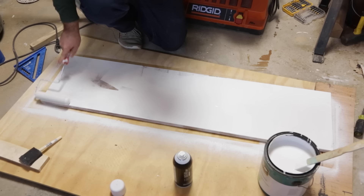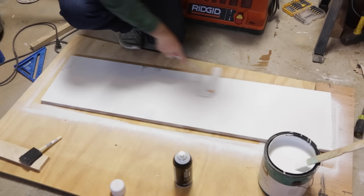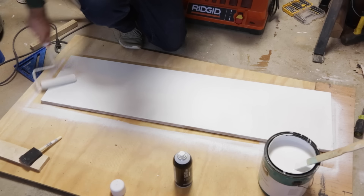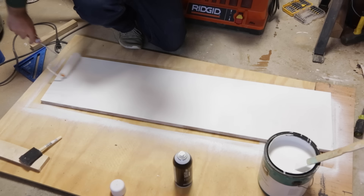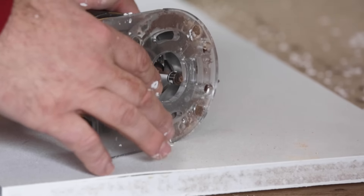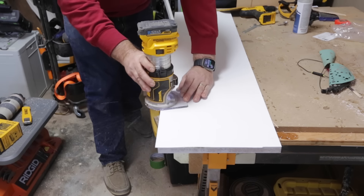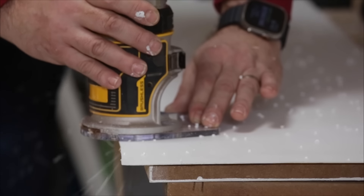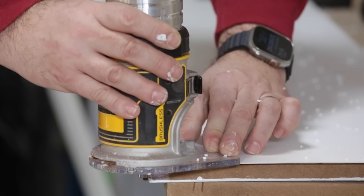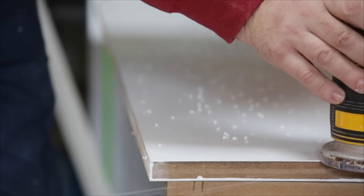For the bottom and sides of the wings, I didn't feel it necessary to put down laminate, but I did want to protect them since this is a portable setup that will be outdoors or in places where things can get spilled on it. So I used a white enamel paint to match the PVC top. To trim the laminate top down, I used a quarter-inch chamfer bit just slightly below the router plate to flush-trim it right to the edge of the MDF. The small chamfer takes off the sharp edges and gives a small bevel so it doesn't catch anything — including your skin.